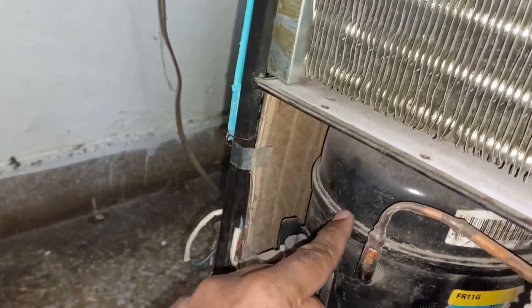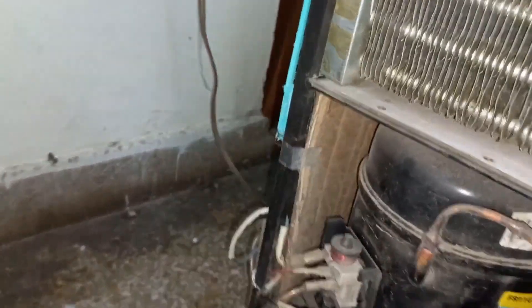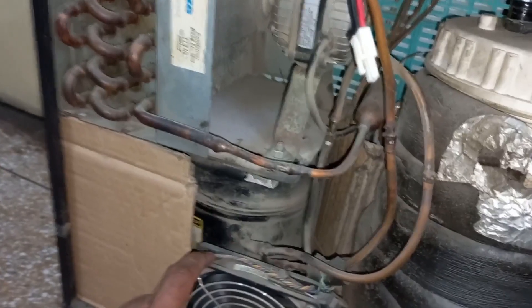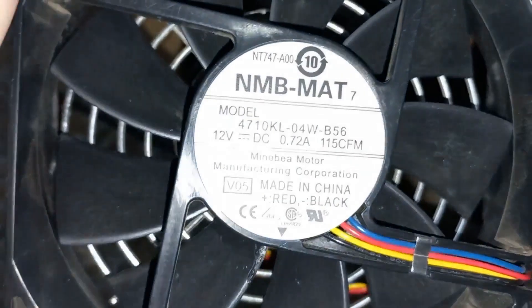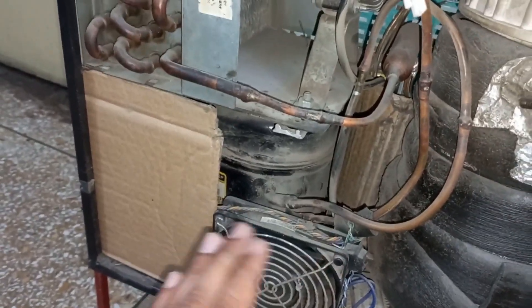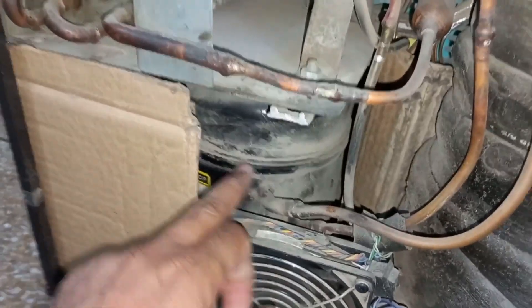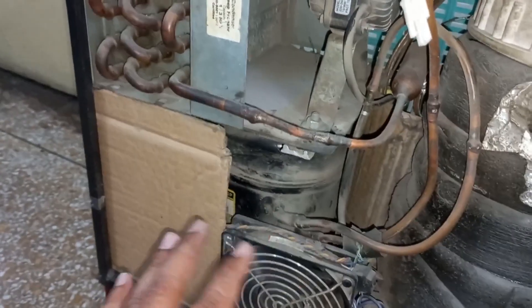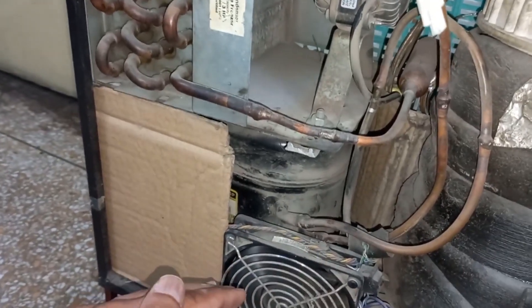The input is a little bit more because air is dividing — half air is going this side and half air going that side with that paper sheet. But very carefully, I have given a little bit of gap on both sides. This gap is because when the compressor runs, its temperature will be near about 60 degrees, so this paper should not touch the compressor — it can catch fire, which will be dangerous. Same, here we have a little bit of gap. This DC 12 volt fan has a rating of 0.72 ampere. I could place a 3 ampere or bigger fan here, but that will create more noise. Also, this slow air may actually work better than very fast air for cooling the compressor. Best results can be achieved with a slightly bigger fan as per requirement.